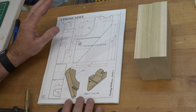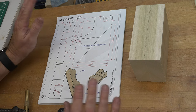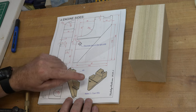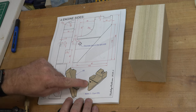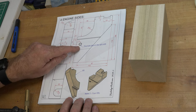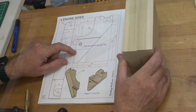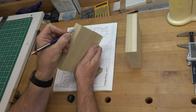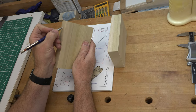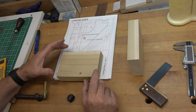There's a lot going on in these pieces, so we're just going to take it step by step. As a rule of thumb, we're going to drill holes first. We have two holes here — this little one, which is 7 millimeters, will only get drilled in the right side. So we're going to mark one of our blanks with an R for the right side to keep it straight, and we'll drill this 4-millimeter-deep, 7-millimeter-diameter hole.